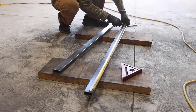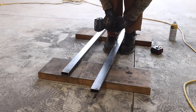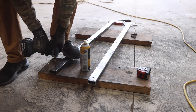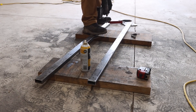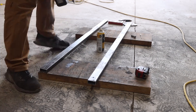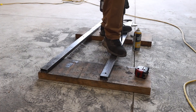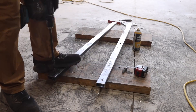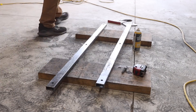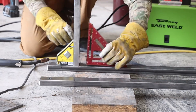One good little tip I learned from a buddy into metal fabrication is that for marking the steel, I actually just use a knife as opposed to a pencil or marker. The nice thing with a knife is that the line is very precise — not like a Sharpie marker where the width of the line might be an eighth of an inch thick. One thing I've really picked up on from Orion is how precise you have to be with steel. Steel doesn't have any wiggle room — if it doesn't fit, it's not going to fit until you cut it to the right size, whereas with wood you can kind of MacGyver it into place.